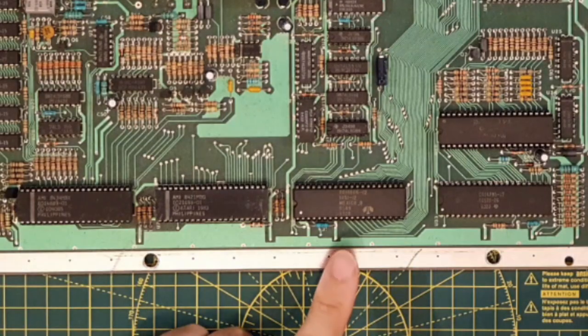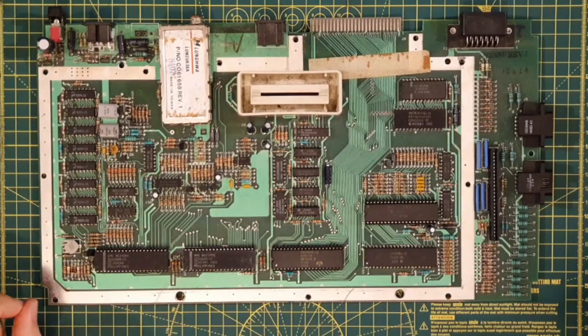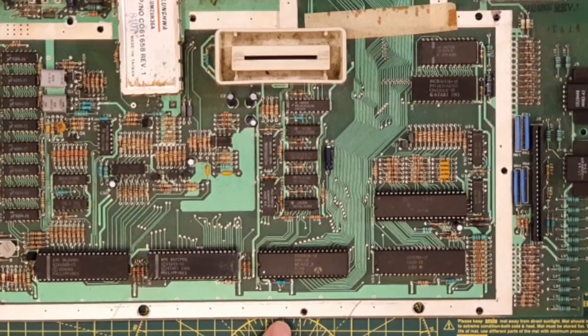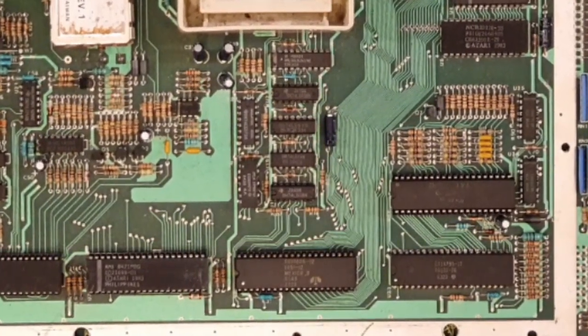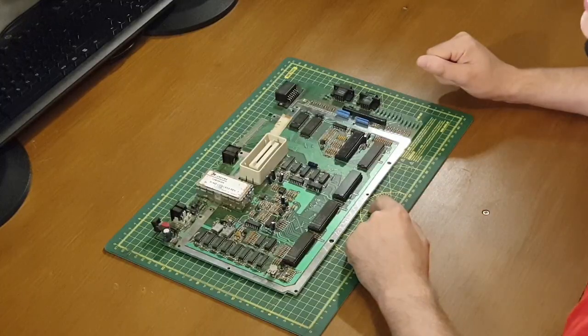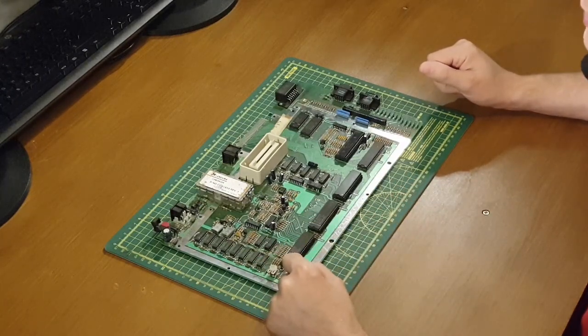The next one across here is going to be our 6502C CPU, or Sally, and this runs at 1.79 megahertz. Now it's a custom in-house Atari produced version of the popular MOS Technology 6502 series of microprocessors. The 6502 series are found in a number of 80s 8-bit micros, notably the Apple II, the Commodore VIC-20, the 64 and the 128, both the Electron and BBC from Acorn, and all the Atari 8-bit systems use derivatives of the 6502.